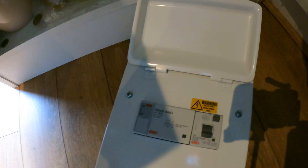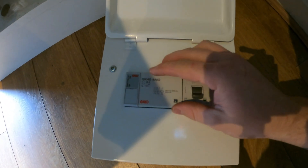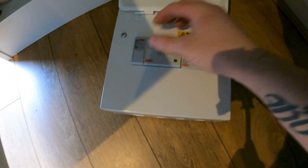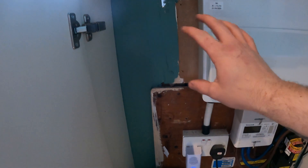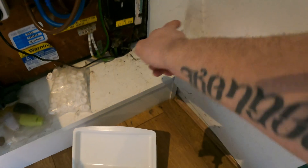It's a nice little touch. It's got an RCD, low contactor, voltage measurer — whatever it's called — and it's a B40, so you can come straight from the tails with that. But we're just going to come from an MCB next to it, then run out the bottom, cross through the wall, and clip up to the charger.